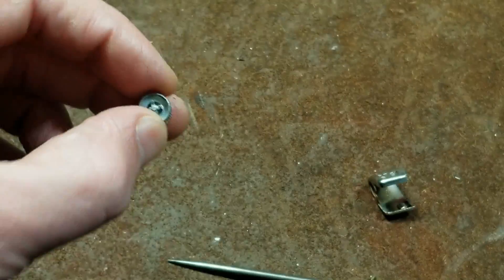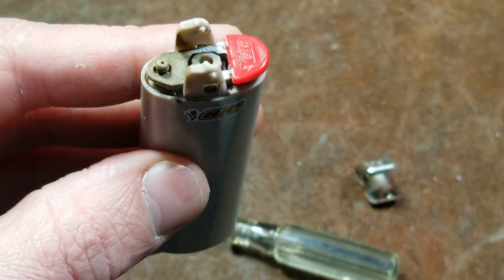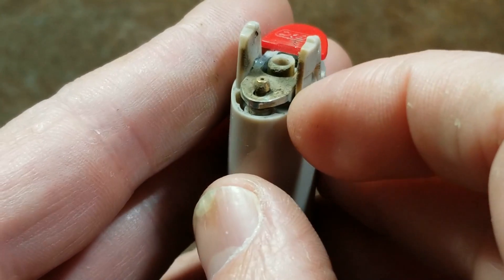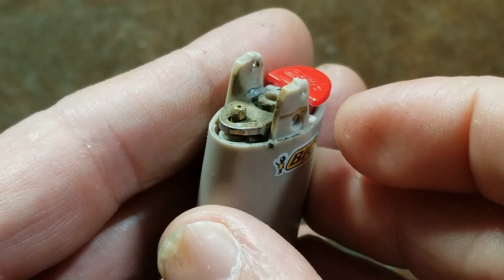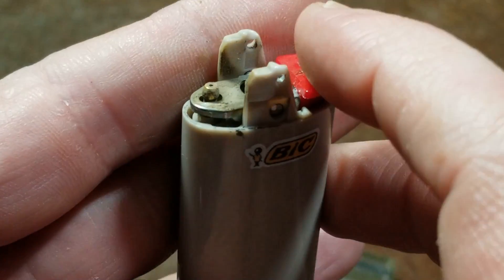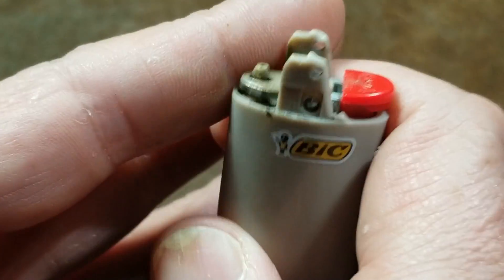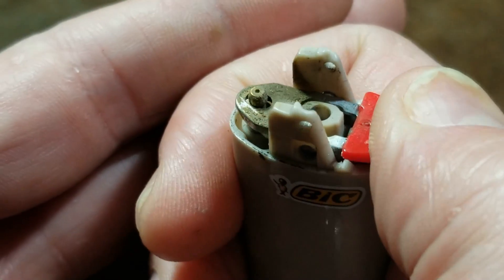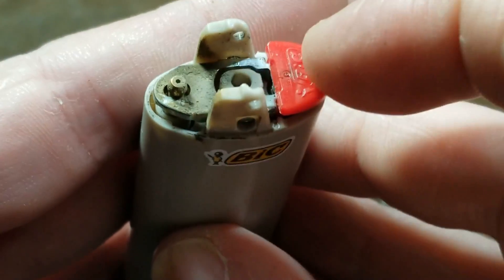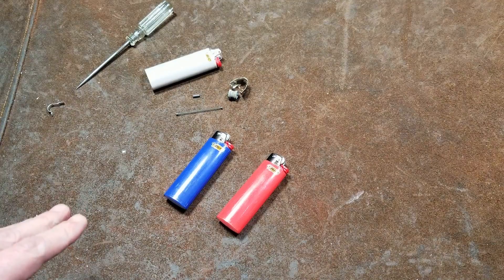The file surface is a wound piece of carbon steel with ridges — basically like a little file wrapped around like a spring. They slide that over the cast zinc piece and press on the other side of the wheel. What we have left is the valve and thumb switch. The valve is now just press-fit into the plastic, making it smaller and cheaper. There are two little notches where the valve is crimped around the edge — reliable but not really disassembleable. There is at least a metal cast zinc lever in there, which is one of the things that makes them reliable and able to sustain being dropped.